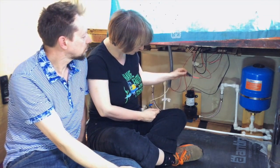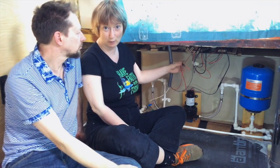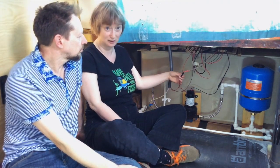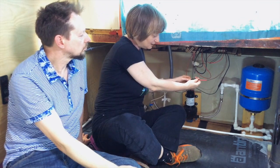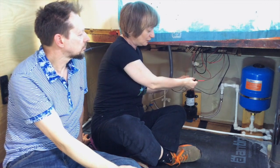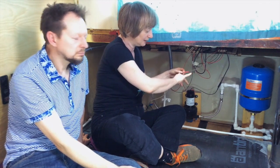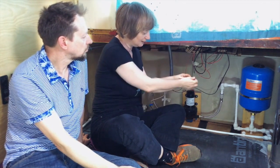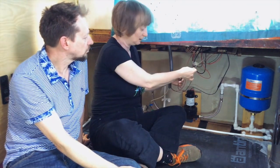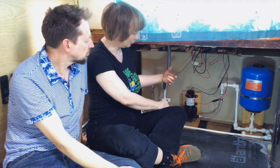And once we feel confident that we've got the right level of wire here, because if I've got too much of it, I am going to crop it back a little bit and then change that connector. Once it's connected properly, I'll put that little sheath over it, I'll heat shrink it so that it forms a better seal, a more waterproof seal. This little bit here is just to indicate that it's going to a red cable, so it's acting as positive. And our blacks are all negative.